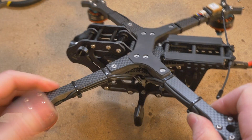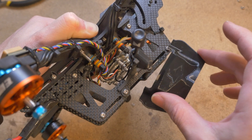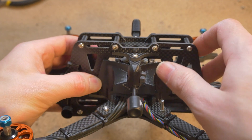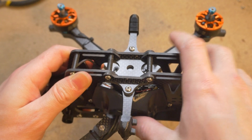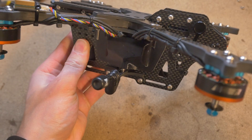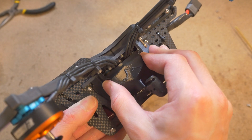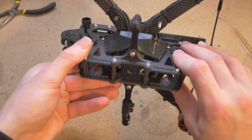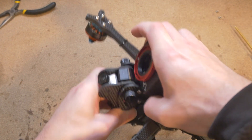This is how the motor wires look when they're zip tied to the arms. I recommend doing a practice installation of the side shrouds to make sure you can get them on without any wires getting in the way. After engaging both grooves on either side, press inward on the center portion of the side shroud to force the grooves to their outer extents, and do a visual inspection to make sure the little grooves are seated. Having these side shrouds really cleans it up. Since you'll be tuning and test flying your drone, I recommend taking them off for now so you have easy access to the USB ports. That's about it for the electronics portion of the Vulture assembly — now you can go out and fly, maybe throw on a camera and get some good footage.